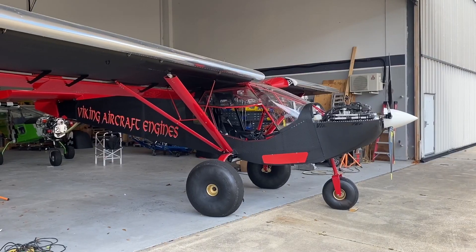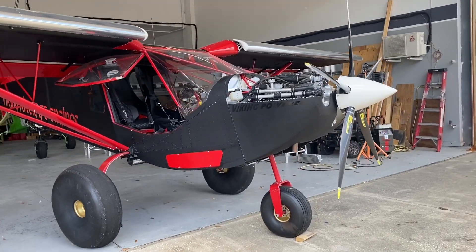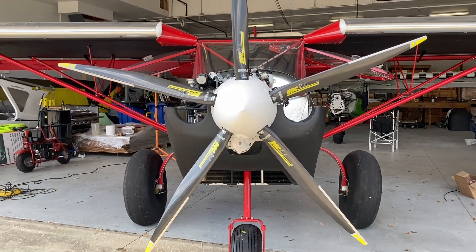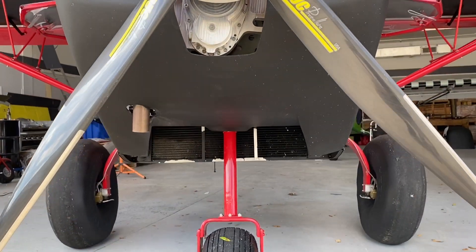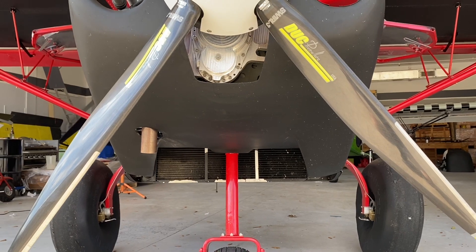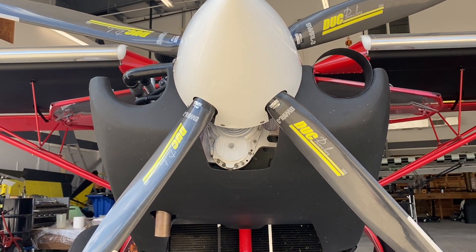The cowling on the Super Duty housing the turbocharged engine is similar to the one that has the air-cooled engine in the factory Zenith demonstrator for the Super Duty using air-cooled Lycoming or Continental engines. The things that are different: there's an inlet on the bottom for the radiator to get cool air directly into the radiator at high angles of attack — when the airplane is doing its best, which is short takeoff and landing flying. There's also an opening for the gearbox to cool it, again for a lot of power and slow flying, and that can be tailored — it doesn't have to be quite that big.